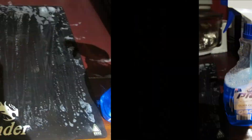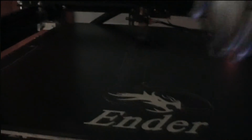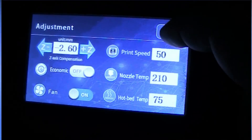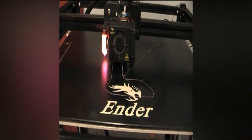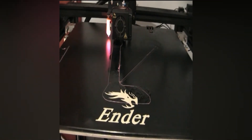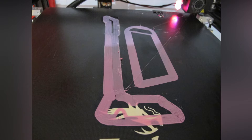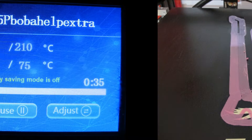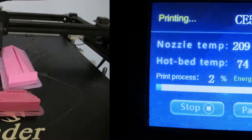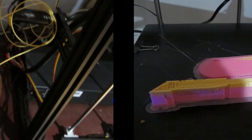At the very first few layers, I slowed down the speed to about 20–30% and sped up when I wasn't in attendance. At a later date, I'll be more likely to pause and start again. Most of it had no issues due to a clean bed and all the parts well maintained. Doing the antenna, on the other hand, came across all sorts of issues including the filament tangling and other cutouts.